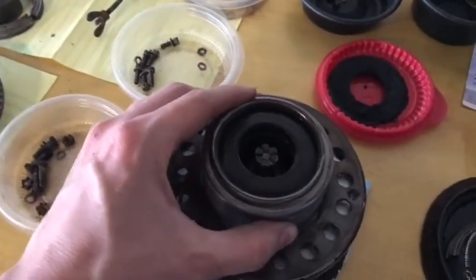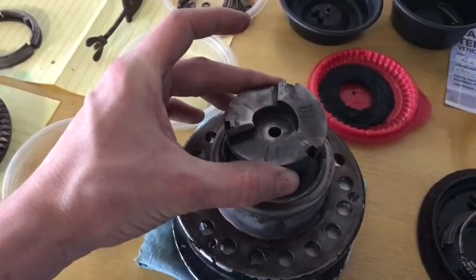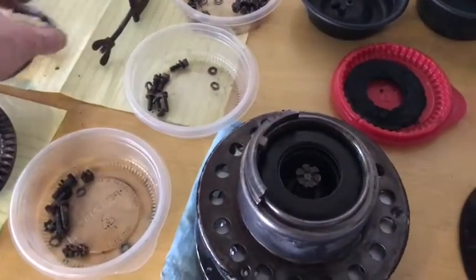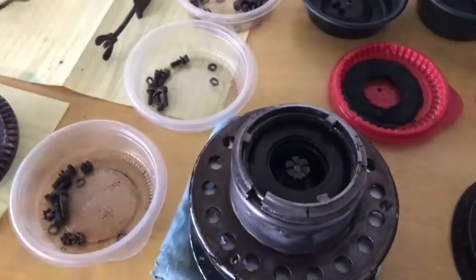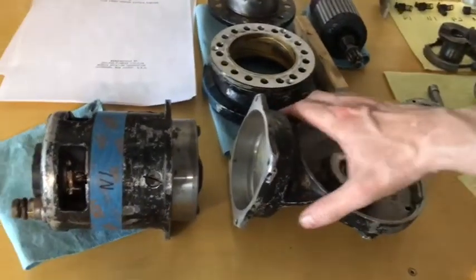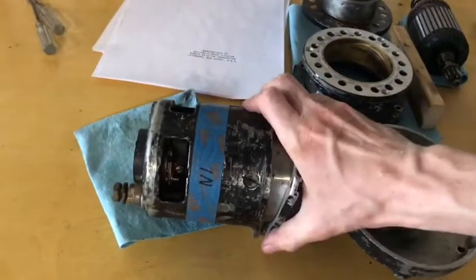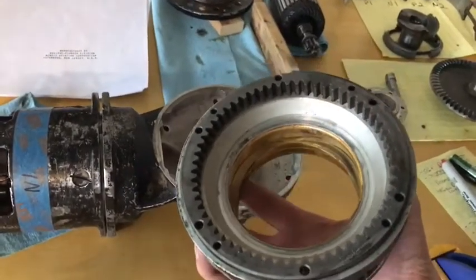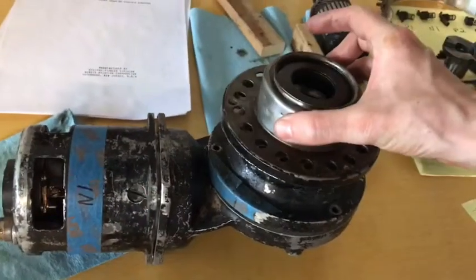This seals around the back of the jaw. Around the outside of that are individual spring compression pieces, and around those are the compression springs. These are the major components, and they mount together. This piece mounts onto the motor, the piece that contains the planetary gears mounts here, and then on top of that is the extension.